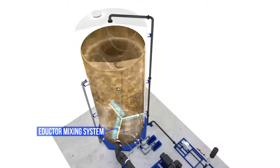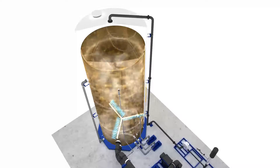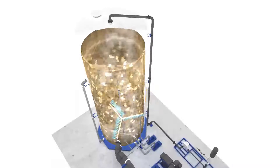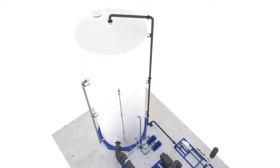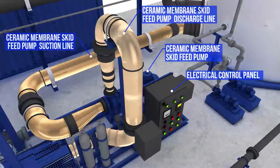the wastewater is fed to Aquatex's proprietary continuously stirred bioreactor. The system's automated jet mixing system facilitates the formation of finely divided biosolid particles with maximized surface area, making it easy for anaerobic bacteria to digest and convert to biogas. Accordingly, the Biomod Anaerobic MBR can remove 99 percent of organics and produce a biogas with 70 percent purity.